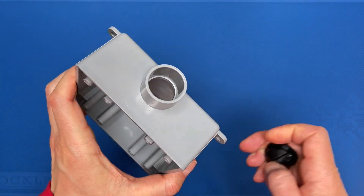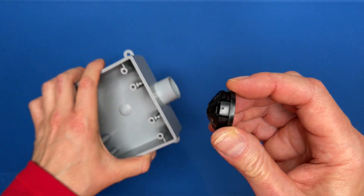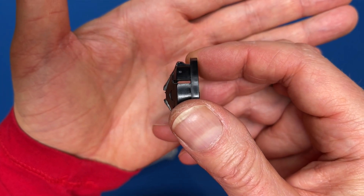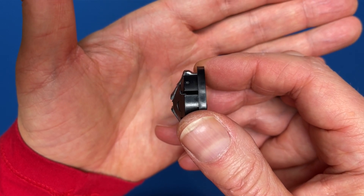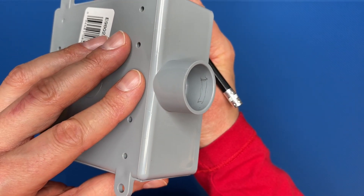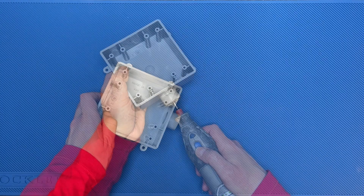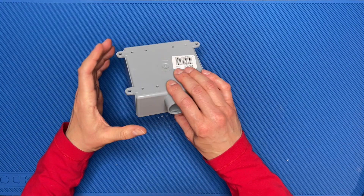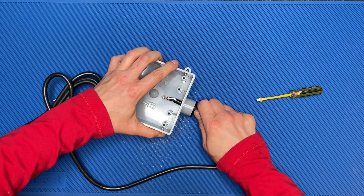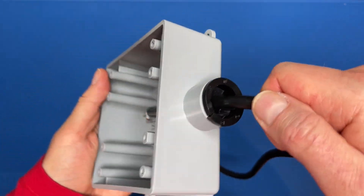Let's build it! First, insert one of the cable connectors into the stub hole in the electrical box. The cable connector will serve to safely hold the power cable in place. Note that the connectors have two compressible protrusions, and the hole in the electrical box doesn't have slots for these, so we need to make them. Mark the inside of the stub hole at two points directly opposite each other, starting about 2mm from the edge, about 10mm wide and 4mm deep. Use a suitably sized Dremel wheel to carefully grind the two slots where marked — only a couple millimeters deep. Now snap the connector in place and feed the cord into the box. Once you put the cable into the connector, it's very difficult to remove, and this is what you want. If the cord comes out when you tug on it, make sure you fix this before proceeding.